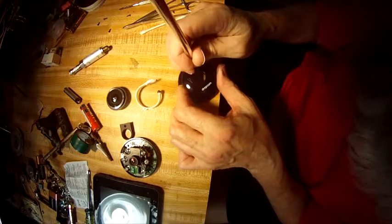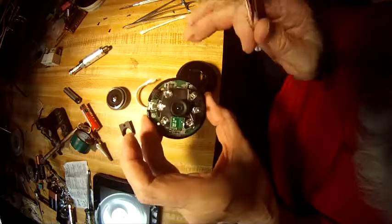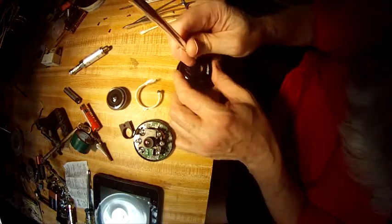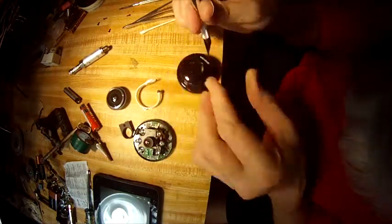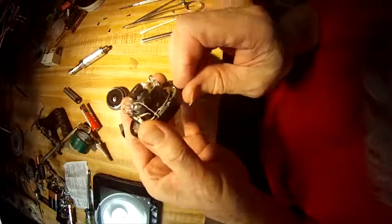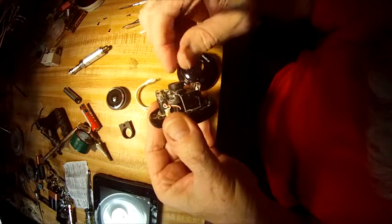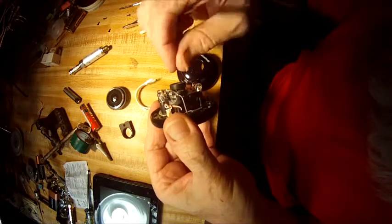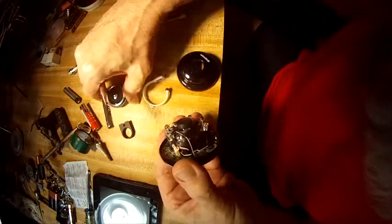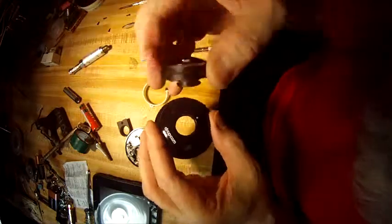This plastic is transparent to infrared light — you can see the LEDs. I wish I could bend them over so they shined a little bit farther out instead of so much in the center; they're designed to be used with the lens that's in here. I removed this plastic right here and turned the lens almost a quarter turn so it would focus on the fisheye, because putting the fisheye on the outside it's not focused.